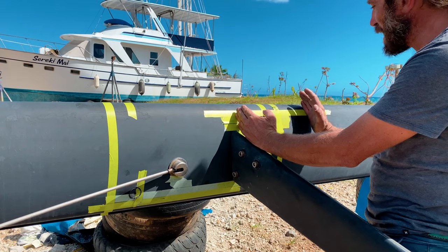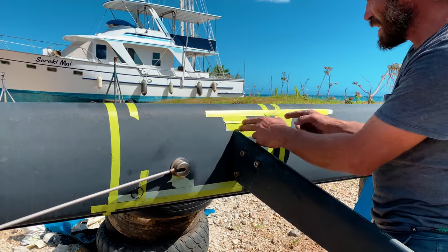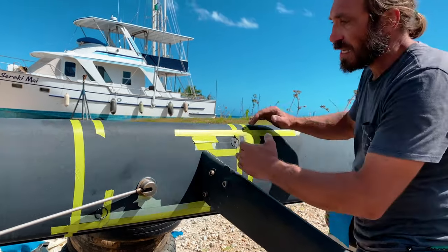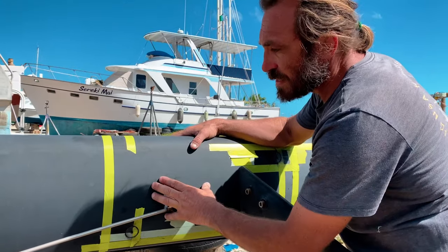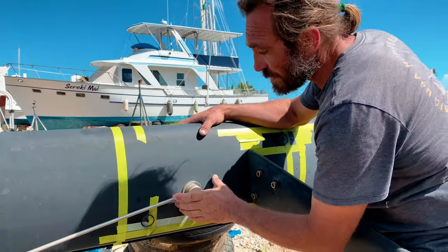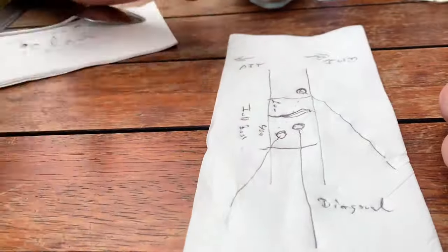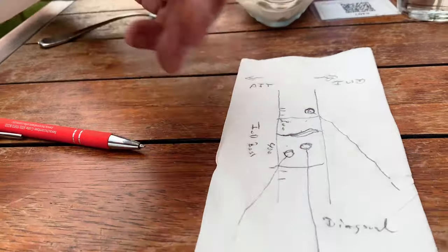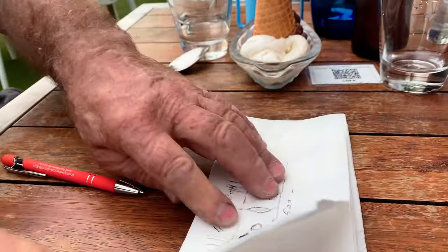This part is the part where it is reinforced, staggered up to 200, is 9 mm pure carbon fibre. Below, because there is not only the spreader, but there is also the diagonal, the D3, there is a reinforcement of 400 and after, staggered. But it's staggered, you know? Staggered by inch, by inch. You imagine it's going like this and it's the next one, and the next one.